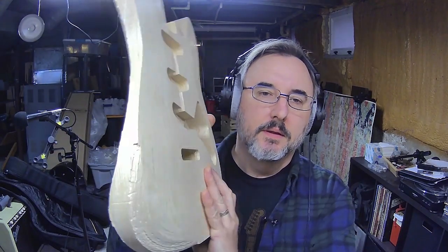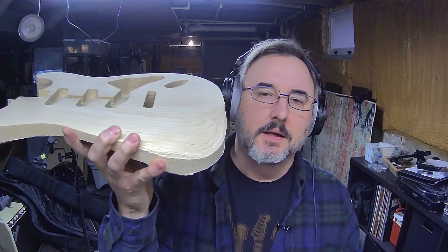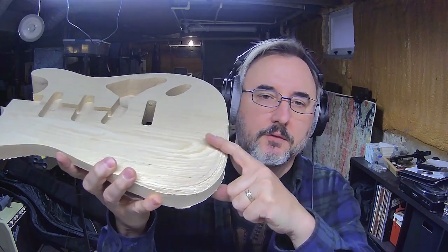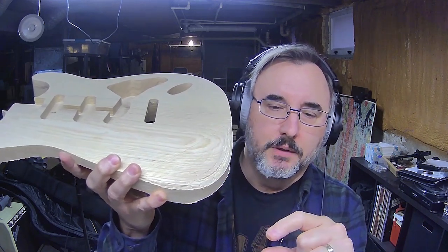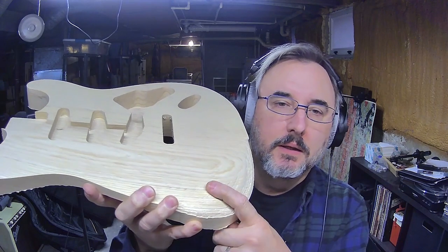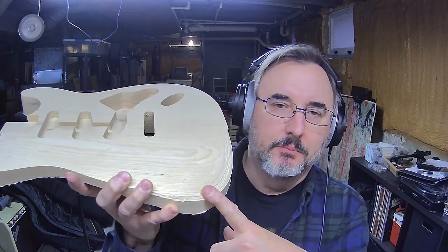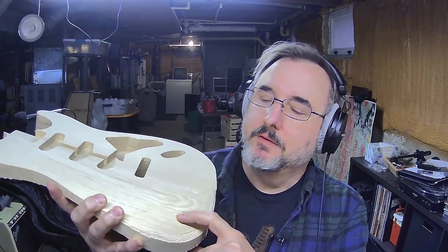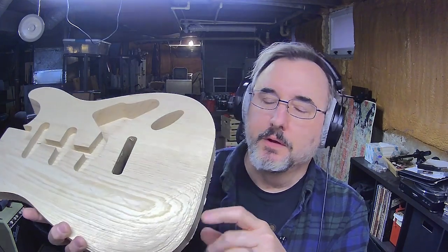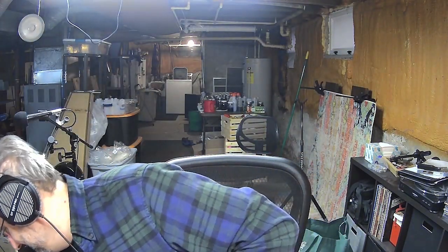You can see the arm contour finish is a little rough, and I think that's because I used the 1/8 inch ball nose bit. My router has a 1/4 inch collet, so you have to use an adapter for the 1/8 inch bit, and sometimes it starts to slip out while it's cutting, and it makes these uneven grooves. So I think that's what was going on. It kind of did it on this part here too. Normally that's really smooth. I'll show you.